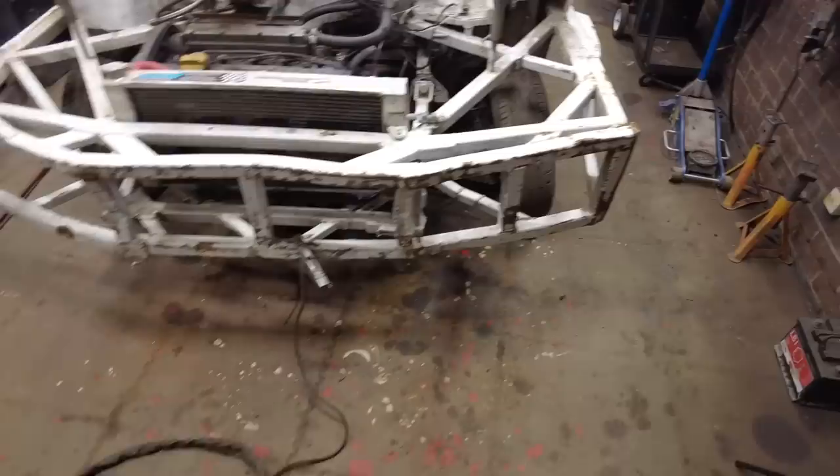The bumper, when you look at it, doesn't actually look that bad, to be honest, from what I'm used to racing with. But I can see a couple of weak bits there. As soon as I have a big one, it's going to shunt off into that chassis rail. As soon as it hits that chassis rail, your chassis rail's bent. And as you can see from a few episodes ago, us doing the chassis rail on the red one, click here to watch that video, it's a pain in the ass, and it takes a long time, because then you've got to do engine mounts, and it takes a lot of time. So it's a lot easier if you just cut the bumper off when you think it needs it and put a new fresh bumper on. I'm going to stick it out a little bit further as well to give me a bit more play when I hit people.